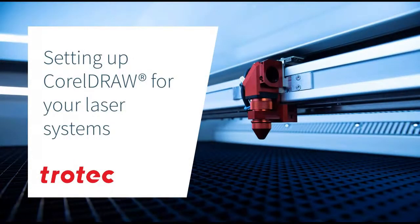Okay, let's go ahead and get going on setting up CorelDRAW for your laser system. This is very important because if you don't set your laser system up properly, the laser is not going to identify certain attributes of the design software so that it can cut and engrave properly. For example, color palettes need to be set up properly to match your laser system. If it doesn't use the right color, the laser system will either ignore it or nothing will happen. Most laser systems, including Trotec, use very specific colors and a very specific page size that matches your laser system. And there are certain things that have to be set up properly in order to run correctly.